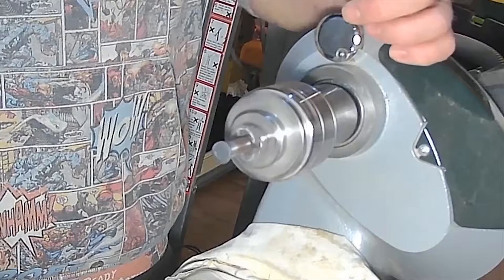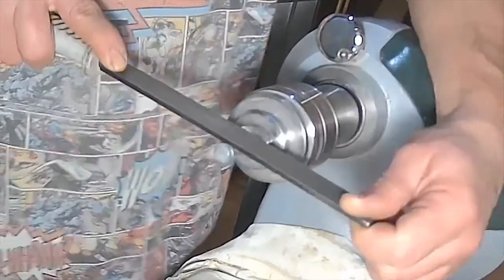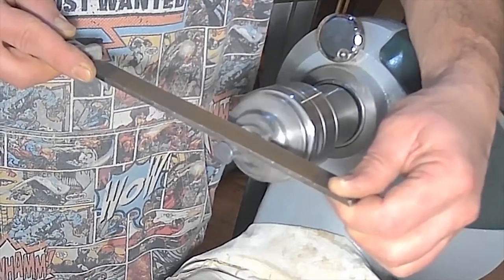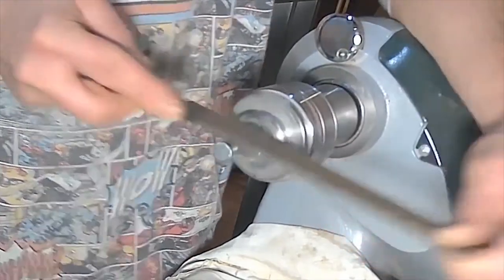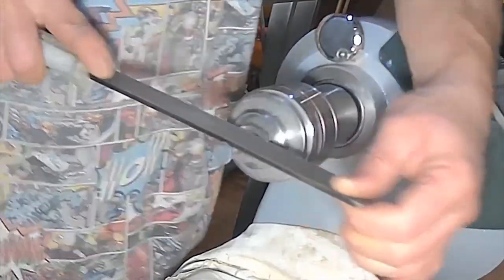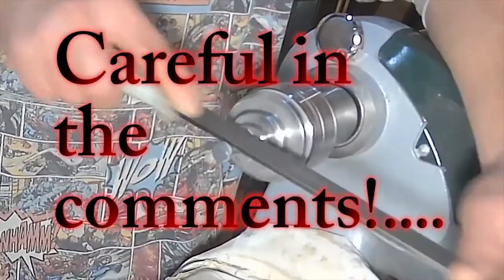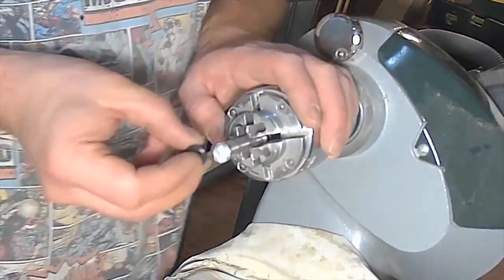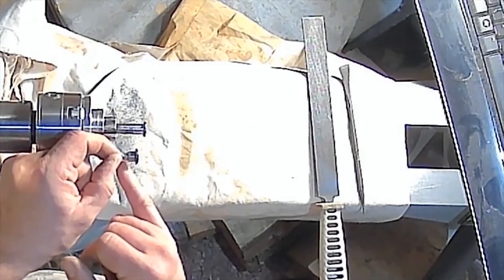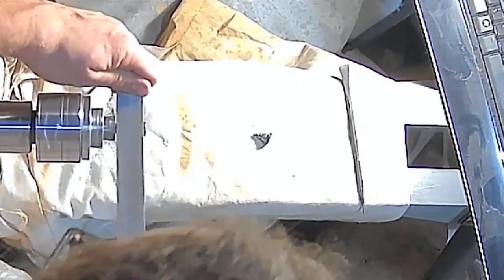I'm going to move to the smoother side of the file. Don't tap hard on your cast iron bed bars — that's not what they're for. Take care of where your safe edge of the file is because you can use it to your advantage. I'm going to cut into that corner again, take the shoulder back slightly, then sit my safe edge in there and press up against it — just leveling off the shaft. That's looking about right. I'm going to take this area of the shaft down slightly more to match the other area.